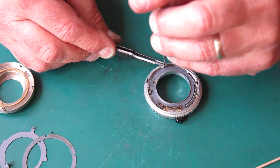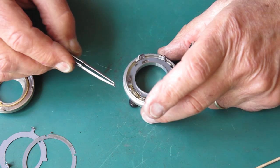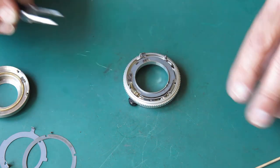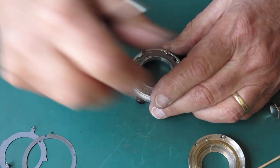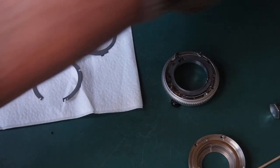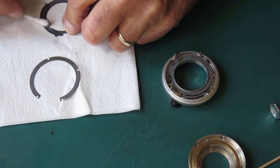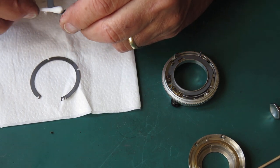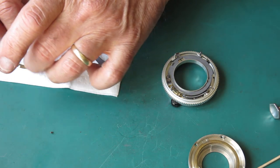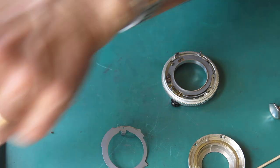You can get these lenses together without aids like this, but there's a reason I use them — it makes life much easier. I usually only use three; there's no requirement for four, three locates things just nicely. Two more pieces to go in — this shim and that piece — I'll just wipe them over with some naphtha. Now all these moving parts tend to move quite freely and smoothly, but if things are warped, bent or damaged, you're going to have problems. Take care not to make a mess of anything.